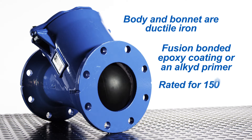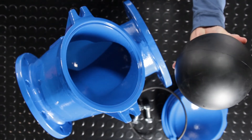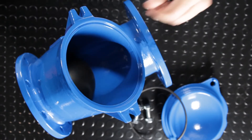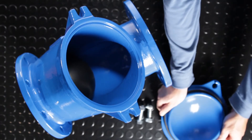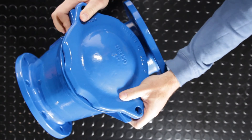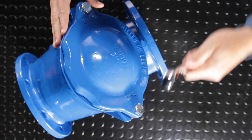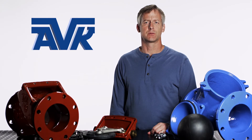The AVK ball check valve is rated for 150 psi. The ball consists of an aluminum core encapsulated with either NBR or polyurethane. The ball can either be sinking or floating depending on your installation requirements. The check valve is sealed with an NBR O-ring and bolted together with steel bolts; 304 or 316 bolting can be supplied. The Series 53 is ideal for wastewater applications. The ball sheds debris as water flows through the check valve. While in operation, the ball will rotate as the fluid goes by and then seal in a different position, ensuring a long life.